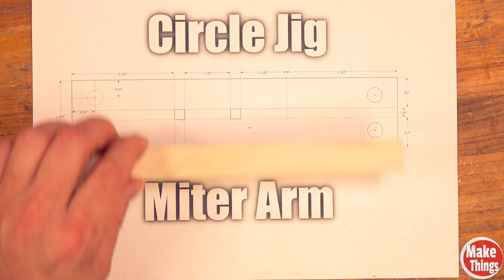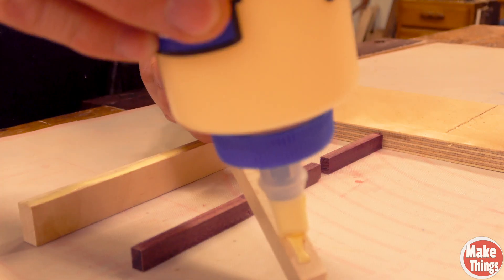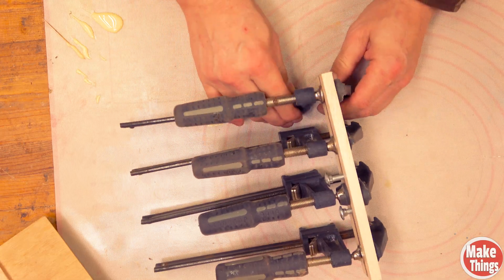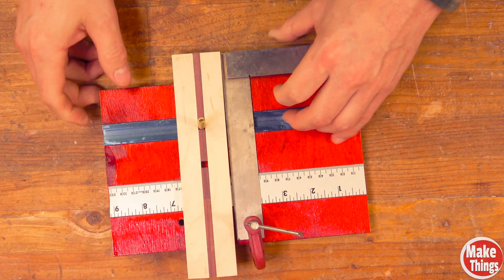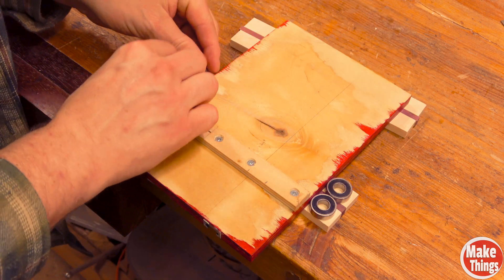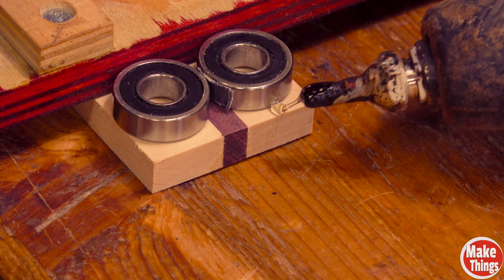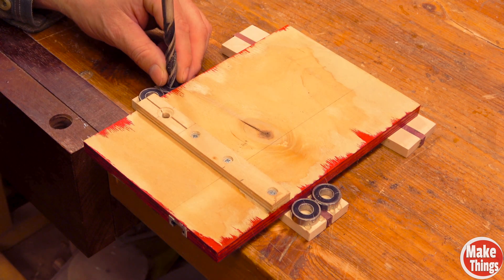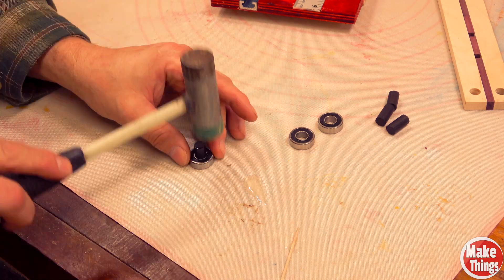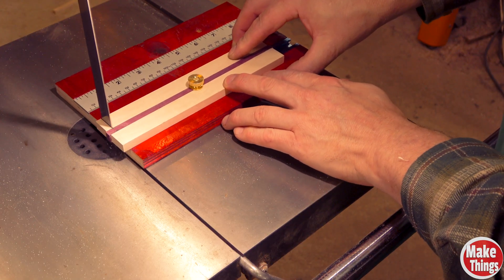With the base done, I moved on to both miter arms. Since I'll be using quarter-inch T-bolts, I used a three-piece section method that will ensure that the bolts are later dead center. I used quarter-inch bolts to get the gap right and clamped everything up. To add bearings to the bottom, I made sure the miter arm was square to the edge by clamping my square and locking the arm in place with a thumb knob. Then I placed both bearings on opposite sides and used a piece of duct tape as a temporary spacer. I used hot glue to keep them next to the edge, used brad point drill bits to mark their location, and drilled them out at the drill press. I made some ebony dowels that I epoxied into the bearings and then glued the dowels to the arm. To finish the miter arms, I cut the horizontal arm to size.